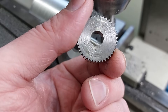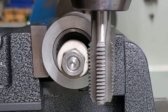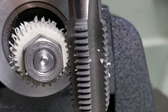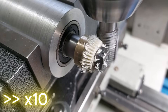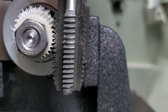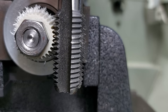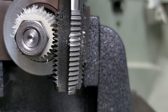Let's try it one more time, but with one small modification to the process. Instead of smashing it against an already running mill, this time I will make the initial cut by hand — hope this will introduce less randomness, and at least I will see what's going on. Looks promising. Let's see what happens if I start the machine. Interesting — that definitely doesn't look like a proper involute, and the teeth have become significantly thinner. Maybe it's because of the tap, maybe I should have started in the middle rather than on the edge, or maybe I just miscalculated something. You can let me know in the comments. But at least the shape looks consistent along the entire circumference.